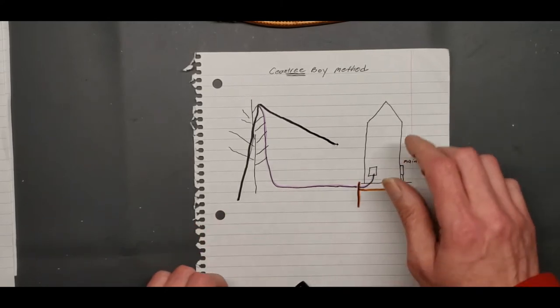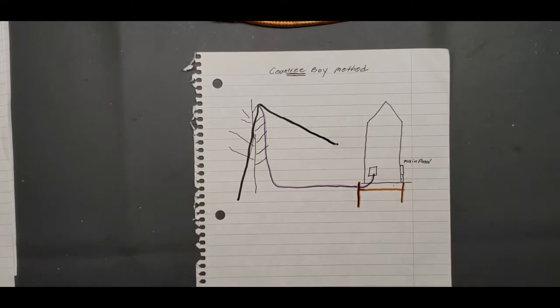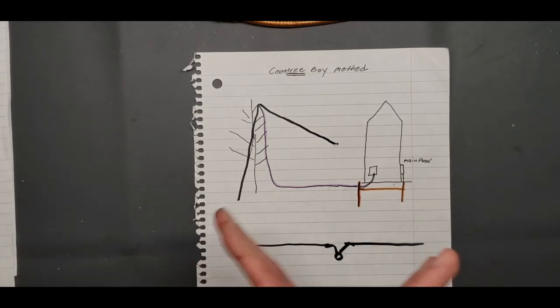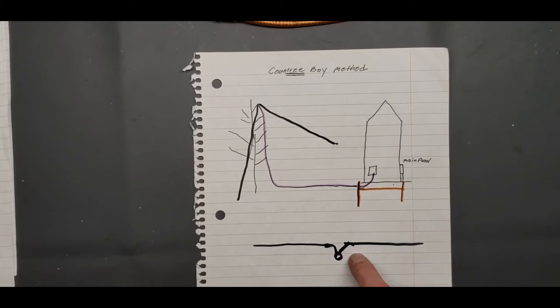And I'll give you a lesson here. A coax is unbalanced. Balanced and unbalanced. The difference is, a dipole antenna has one leg there, one leg there. Coax hooks to the middle. One goes to there, one goes to there. It's working positive and negative on two planes parallel to each other. That is a balanced antenna.